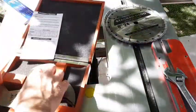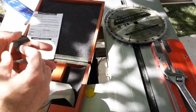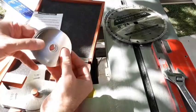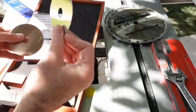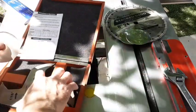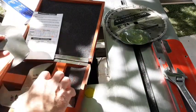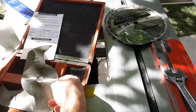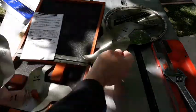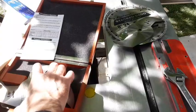Then we're going to get two of the thickest spacers, because the instructions say to use the thick spacers between both blades. And then I'm going to use two of the eighth-inch chipper blades — one and two.